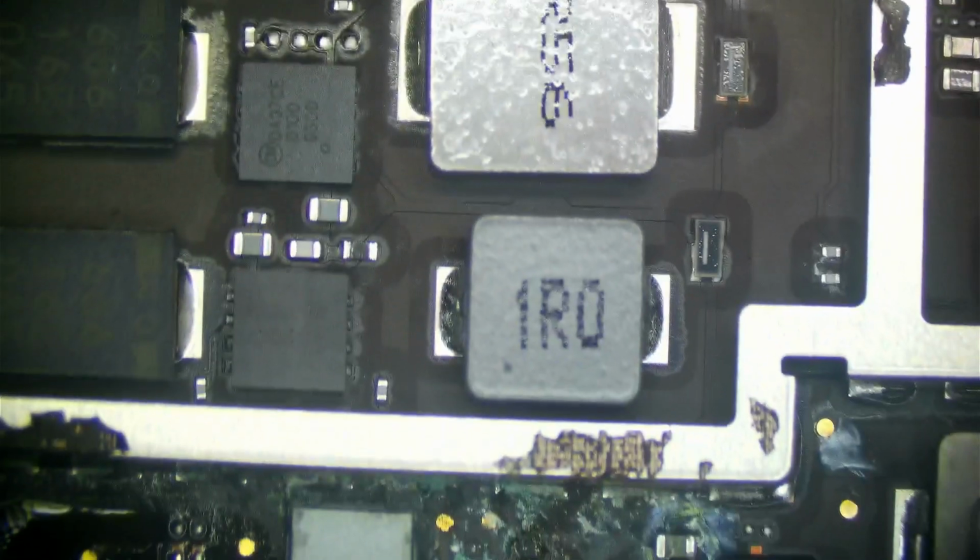Again, same kind of deal on this capacitor here. I'm probably just going to flick it off because I don't know what value it is. I'd rather just leave it off than put the wrong value and have the wrong value fail, because a capacitor is not really something critical in a circuit, at least in the application that these are being used as. So I do not think that one is important there. That's just for smoothing. We'll look closely, but that's probably just a PP bus or 3v3 AON cap smoothing, which is not that important. Otherwise, it's pretty unremarkable.